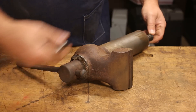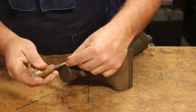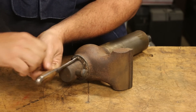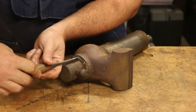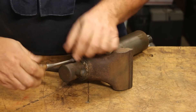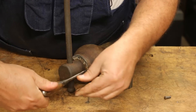The screw fits up through the vise and it's captured here on the end. The way it's captured is there's a little clip that goes around this — it's held in place with three screws. We're just going to take these screws out. And while I'm doing this, one thing: any time you're doing a restoration project of any kind, even on something simple like a little vise like this, as you're disassembling it, have a digital camera in the shop with you and take lots and lots of pictures at every imaginable angle so that when you go to put it back together, you will have a very good reference on how it came apart.